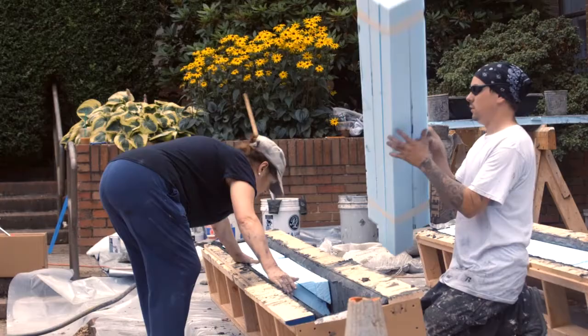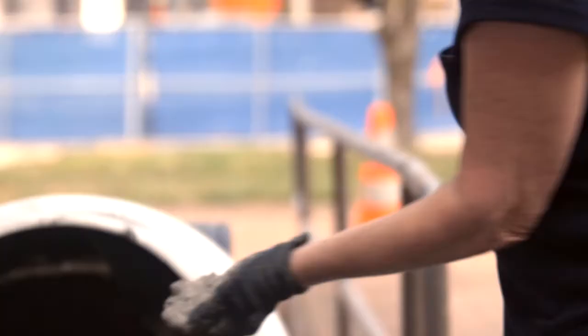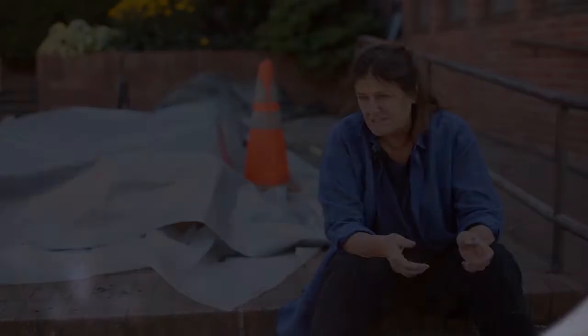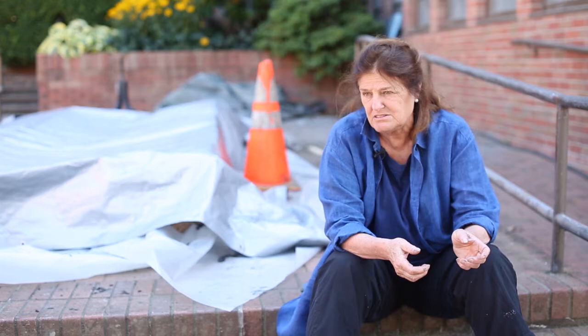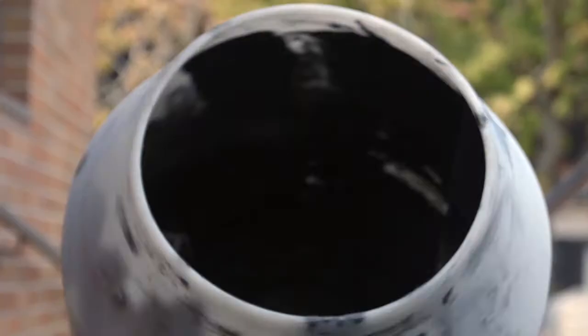What I did was change the technique. Instead of making it solid cement with rebar in it, which is an old-fashioned method, we've done it with what's called glass-reinforced cement, which is called GFRC. You make the mixture with half Portland, half sand, a polymer additive, and fiberglass strand.